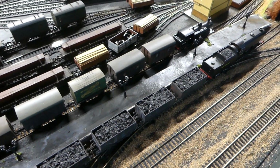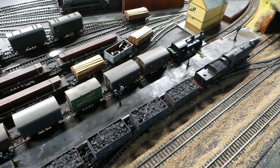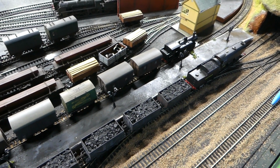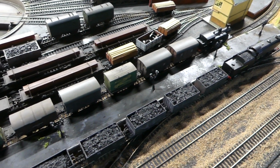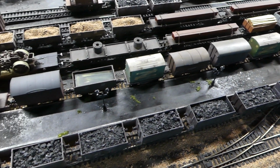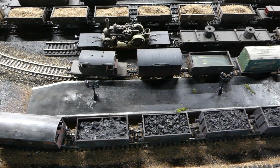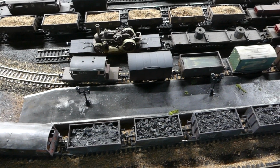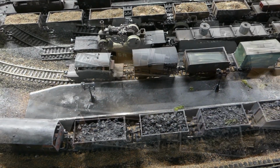Anyway, I smelt something and the resistor was overheating and burning. So for some reason, and I don't know because I'm not an electrician, I hate electrics, I don't know why, but the resistor burned out. There's a 1K. It was feeding all of these. Maybe it was just trying to feed too many. I don't know. Maybe I should have put resistors for each light. I thought I was doing the right thing, but I took the resistor off and the lights came on. So I'll just stop it here and come back with the lights on.